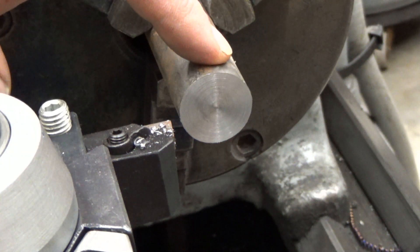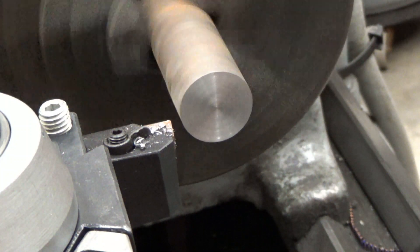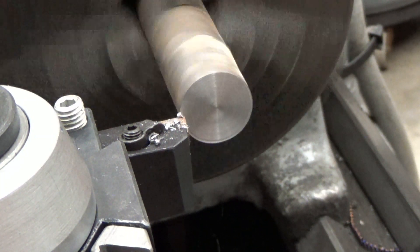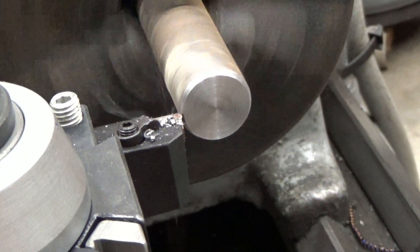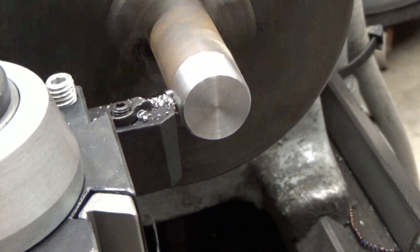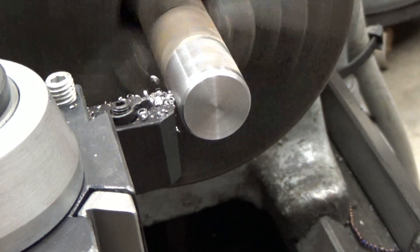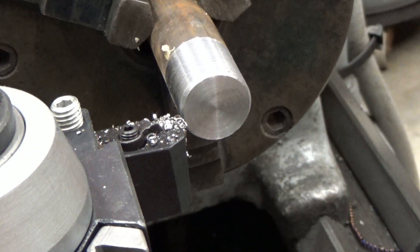So that's what's called facing, and then the next thing would be to turn down a diameter to a certain size. We've got this trued up, so now we can go ahead and turn the shaft down to size. You can see we've got a little bit of a wobble — that's going to go away once we start turning this down and feeding the z-axis. That's a bit of a heavy cut so I'm going to back off a little bit. The quality of cut we get is relative to how good our hand work is in maintaining a consistent speed across. This is quite rough, but there's an idea of the basic facing and turning operations.